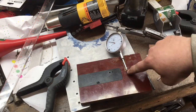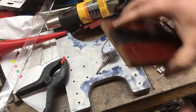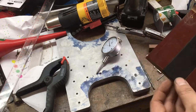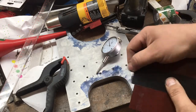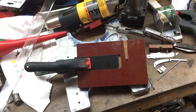Put your pivot point right at the end where your indicator is going to sweep that. These holes are a little bit less critical. This one does have adjustment — you really don't need it to slide back and forth if you're making the same kind of slip joint all day long. Just put it in the same spot every time, or you can kind of drill around on your board as needed. This just makes it a little bit easier to adjust, and if I need to fix it, I just use a spring clamp. That video probably went a little longer than it needed to, but if you have any more questions, leave me a comment or send me another DM. That's kind of it in a nutshell. Thanks for watching, guys.